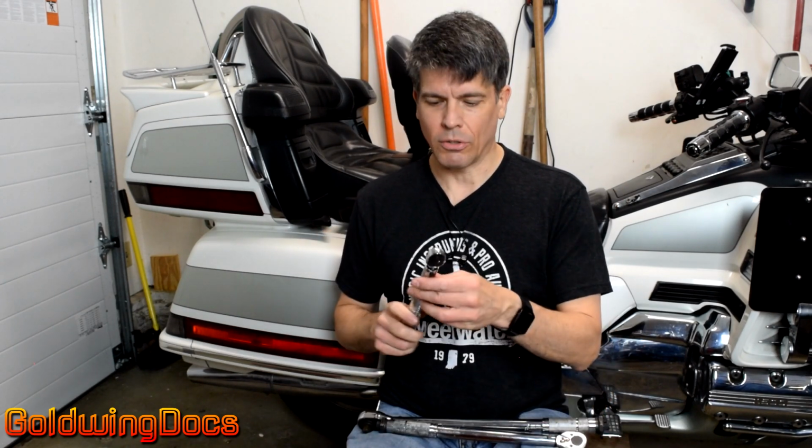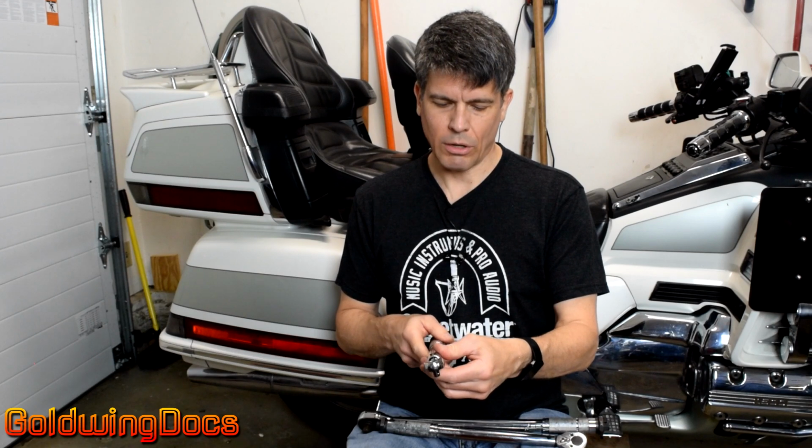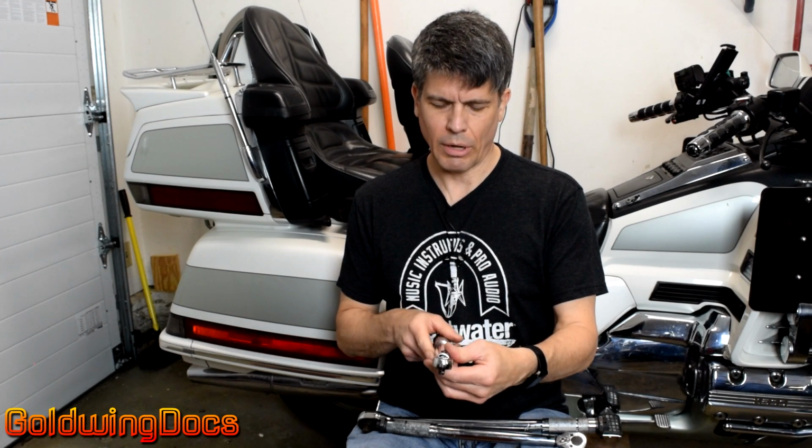The 2 larger ones measure in foot-pounds. The smallest one measures in inch-pounds. You can translate from inch-pounds to foot-pounds, obviously just by dividing or multiplying by 12. So 12 inch-pounds is 1 foot-pound. Depending on the sizes of the wrenches, they have different ranges. This one goes from 20 inch-pounds to about 200 inch-pounds. So roughly 1.5 foot-pounds to whatever 200 divided by 12 is.